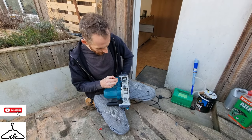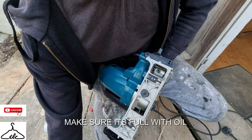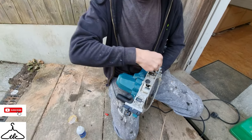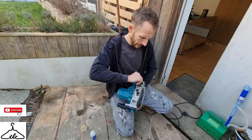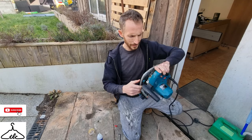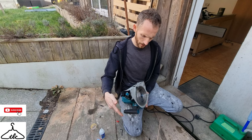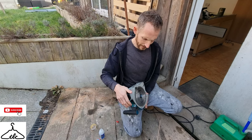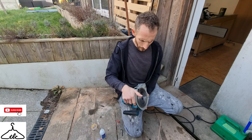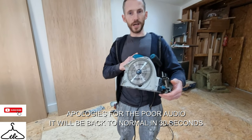I don't think you can easily remove the actual pin, and I'm not going to risk taking it out and having the whole saw fall apart. So now I've done that, I'll simply put the grub screw back in and nip it up, then lift the saw up and down a few more times and it should free up. If it doesn't, just repeat that process a few times. It's already 10 times better than it was.